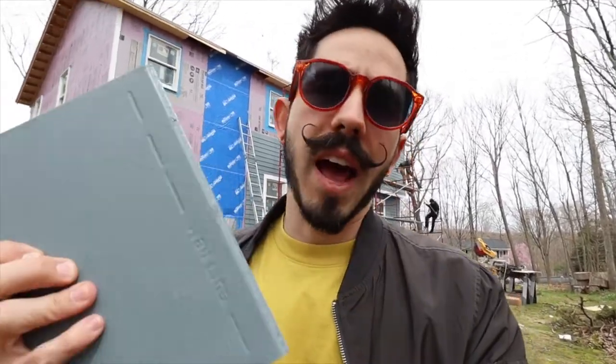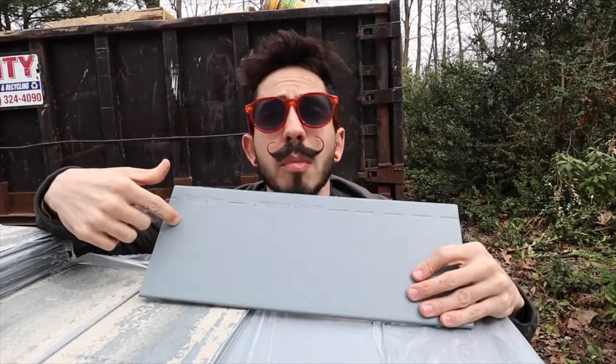Hardy board is pretty awesome because vinyl is cheap, it can warp, and it doesn't last that long — the advantage of vinyl is that it's cost-effective. Hardy board is a little bit more expensive but because it's a composite fiber cement material, it's fire resistant, weatherproof, and termite resistant, so it's really going to outlast the natural products or the vinyl products. The other cool thing about hardy plank is that it comes finished — once it's installed you don't have any maintenance, you don't have to paint it, resurface it, or do anything.